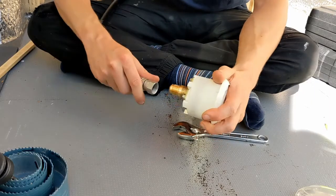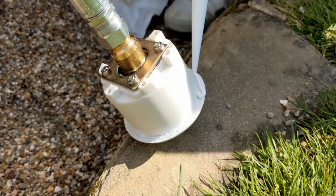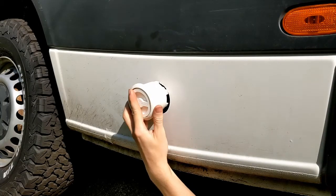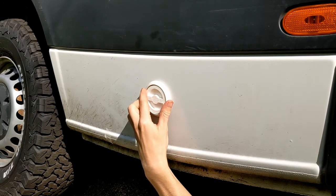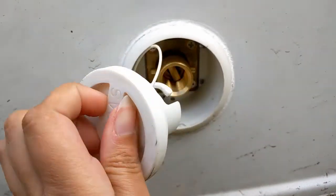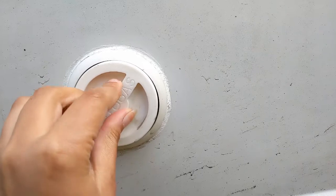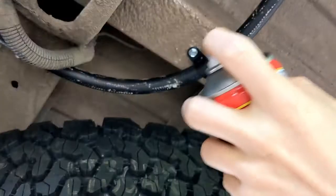It's going to be a bit awkward to reach once we're in there, so we're going to do up the filler hose now. Once the hose is on nice and secure, we're going to put a bunch of sealant around the filler cap to keep out any water or mud. Then it's simply a case of feeding that hose through, popping the filler point into place and making sure it's lined up straight. The sealant was more for waterproofing than fixing — for that there are screws that go into the back. We've since driven the van and it was quite wet and muddy, but it's still on there nice and firm and the filler cap is doing its job — clean inside, unlike the outside. Finally we ran the hose up into the tank and secured it with clips, which we've sprayed with wax oil to protect them.